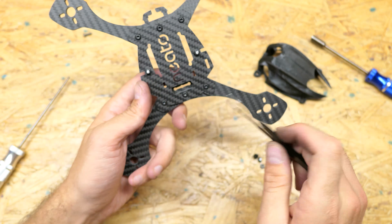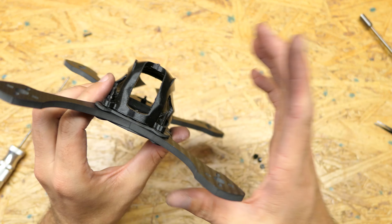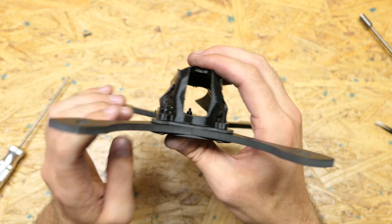The pods — we're currently using a new material. This is not TPU, this is a more sturdy material called TPE. It doesn't come in as many colors as the TPU you've seen on other Neato frames, but it's much stiffer. That's a lot of pressure right there — I'm squeezing one-handed and I'm shaking I'm squeezing so hard. It's going to take a better impact than the TPU pod. A TPU pod flexes a lot, a lot easier than the TPE — that's why we're going with TPE right now.